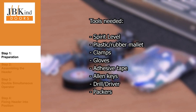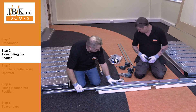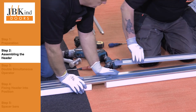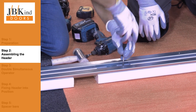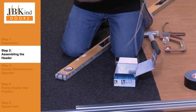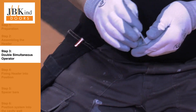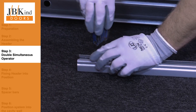Please remember to wear gloves as some of the component parts can be sharp. Lay both cassettes flat with the double leaf conversion kit. Connect the top rail sections ensuring they are secure. U-shaped brackets are provided that can be clipped onto the rail and then fixed to the wooden stud head. Please note that they were not included for this installation due to space limitations. If you would like the pocket doors to open and close simultaneously, a double simultaneous operator can be fitted, which is essentially a cable fitted to a pulley.